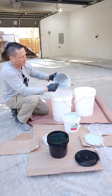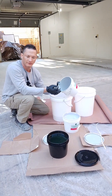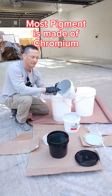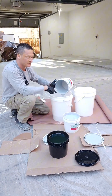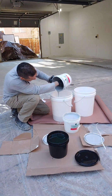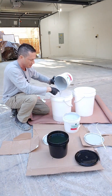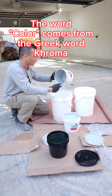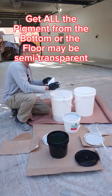This epoxy comes pre-pigmented. Pigment is typically chromium or titanium dioxide — a metal powder that's been liquefied — but it's heavier than the coating, so during packaging it settles. The bottom of this has most of the pigment. So even though I poured most of it out, if I didn't scrape the bottom, the result would be semi-transparent because it doesn't have all the pigment it should — it's sitting at the bottom. That's like an eighth of an inch of coating stuck to the bottom, and that's mainly the metal, the chromium. That's where we get the word 'color' — from the Greek word 'chrome.' So always scrape the bottom of your A and make sure you get all the pigment.